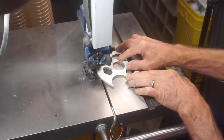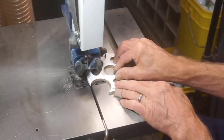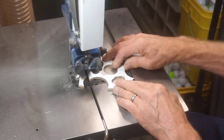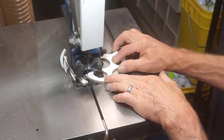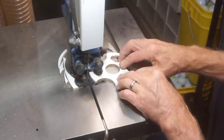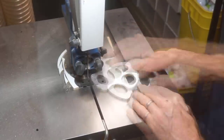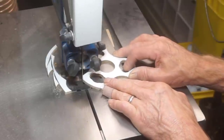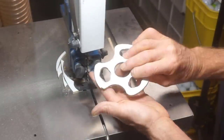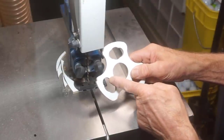I'm using a bandsaw because I can, but the half-inch blade I have in it right now is just a little wide for cutting a radius this tight smoothly. But with a little creative carpentry technique I still get the job done quickly, accurately, and easy. I'll also use the arcs I drew using that 14-millimeter socket as a guide to remove the bulk of the material for rounding off the six corners of the template. I nicked the template — but I've got bottles of Starbond glue that go in this caddy and I'll use those to bail me out.